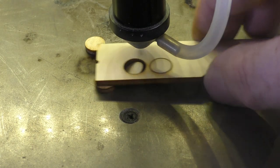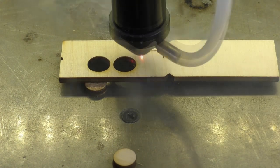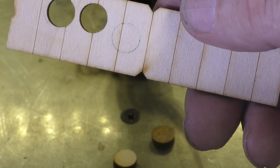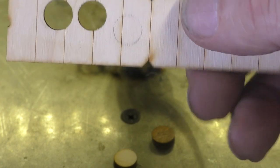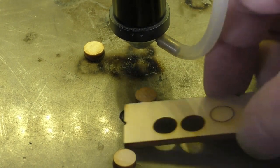We'll find out what speed we can cut at the center of the machine at 800 millimeters. Currently I've got it set at 15 millimeters a second. 15 is okay - let's go to 20. It's already matched the 40-watt machine, and this is basically 30 watts. It didn't fall out at 20; it pops straight out. Let's try 25. 25 has not quite made it - I might be able to push that out, but that doesn't meet my requirements for cutting.